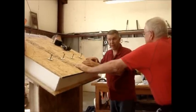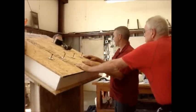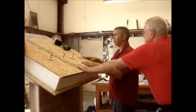So when you're setting this panel, I'm not worried about this being flushed down here — I'm worried about what my joint at the ridge looks like. And that's a lot more important.